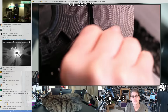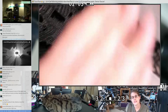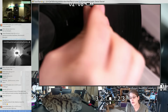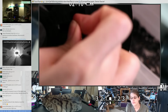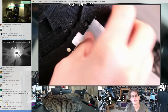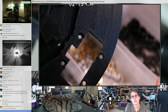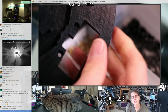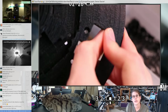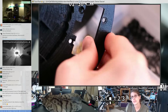But there's this whole space on the sides of the carbon fiber rods where it's going to be a little bit ugly inside. I'll have some wiring going up and down, and so I think I'm going to want something to cover up the innards of the robot. And so one option that I've been strongly leaning toward is to 3D print basically little half-cylinder shells that just snap onto the carbon fiber rods on each side. And then you could just snap off those shells for maintenance. I think that would work out nicely.